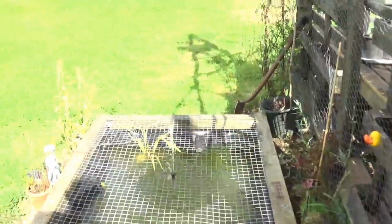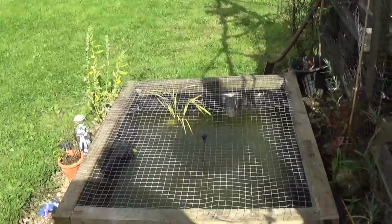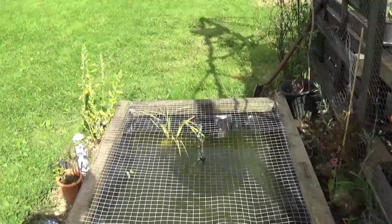Switch it off. So like I said, mainly the switch would be on the positive side of things, but it's just a switch. It's just to turn it on and off to break the circuit, basically. If you're breaking the circuit either on the positive or negative side, you're still breaking the circuit. But this is just operating one pump, so I'm not fussed about that at all.